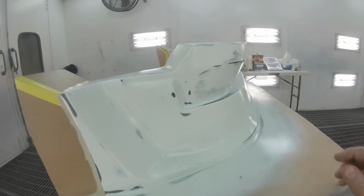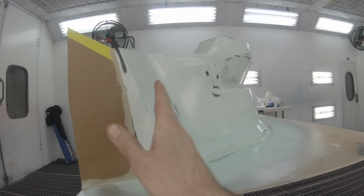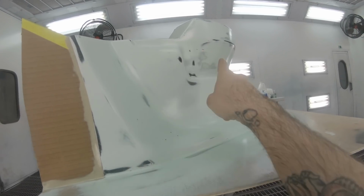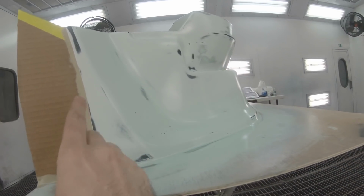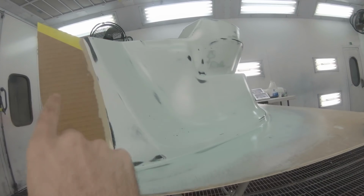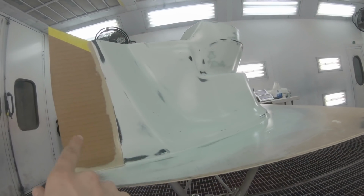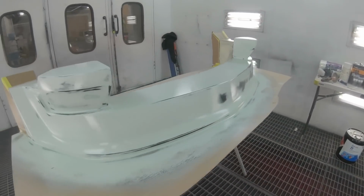And that's because if you see this angle here, if there's a piece back here, this is going to have to drop out the bottom. Basically, it's not going to be able to pull back enough to release this little lip, because it's going to be hitting against here. So what you'll do is make your part, unbolt the back two pieces of the mold, and pop it out that way. With the back pieces of the lip gone, it should be fine. So that's pretty much the game plan.